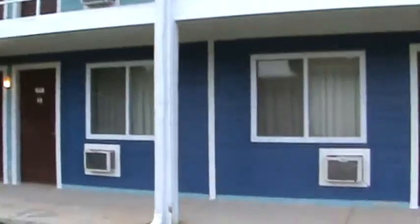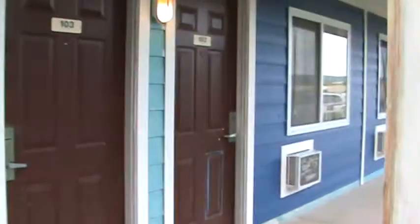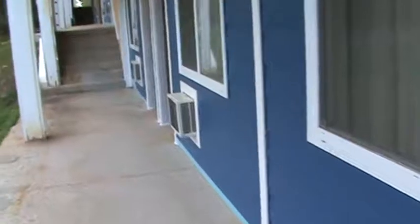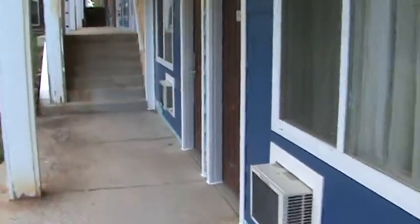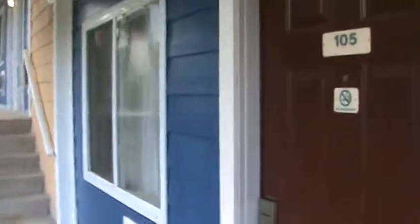Get that trim painted a good coat. Then come back, do the color coat change. Color change on the wall. Then the building looks different, looks done. Then we come back, we do these smaller areas in between the doors, the stuff that only I notice. What we need to pay attention to in the meantime, as far as prep work is, filling the nail holes and caulking this trim.